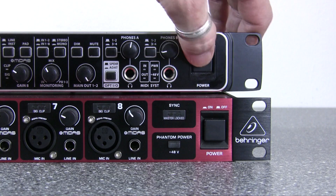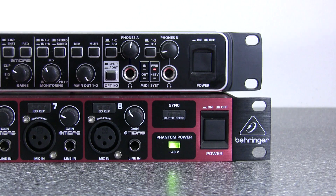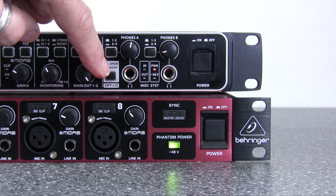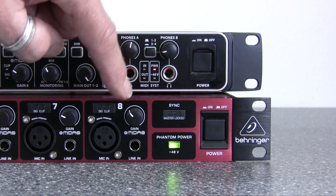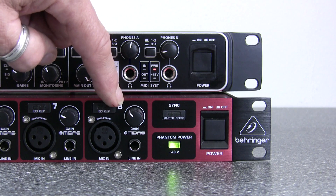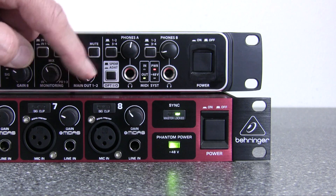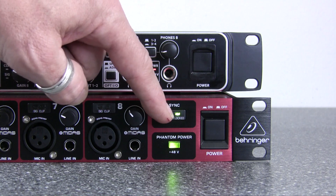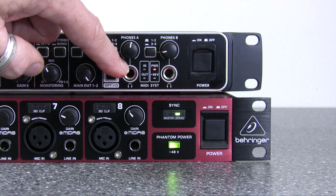Round at the front, let's power them up. On the master device we switch the optical in/out to ADAT to enable the ADAT outputs, so it can send sync out to the UltraGain Digital as the slave. As soon as we switch ADAT on, this unit sends sync and the UltraGain Digital becomes sync locked to the USB interface.